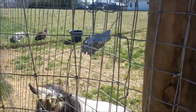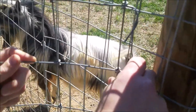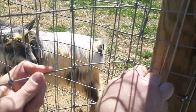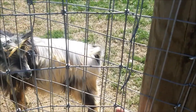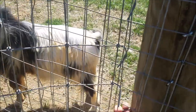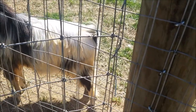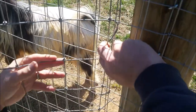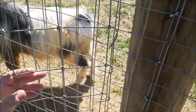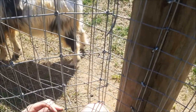What we'll do today is take the ends — this is the easiest way to work with the woven wire first — and just wrap that around. This will really create a hinge point for the end of your fencing, and that just makes it easier to handle so when you unroll the rest of it, you can stretch it out and it's not going to come apart. You don't have to nail anything just yet; we'll come in and put some staples into the post later to keep it secure, but right now we're just going to secure it this way.